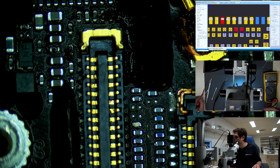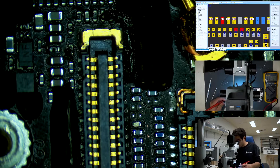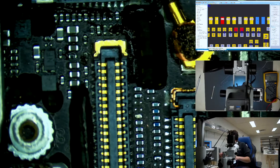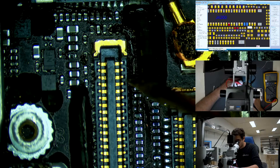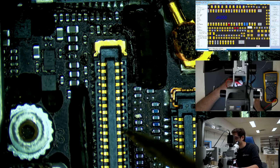We mounted the filter on the reverse side from where it was originally mounted, because of the damage — it doesn't look nice on the top side since that's where it was damaged and pulled off, but the other side is fine, so the filter should be good. We're going to test in diode mode on that pin now. Counting 11 down — now we're getting the accurate reading in diode mode, which is good.